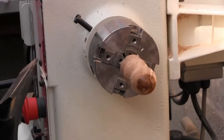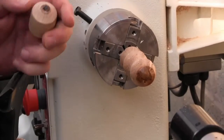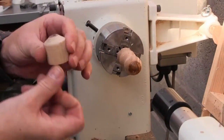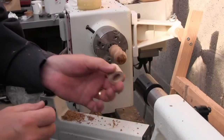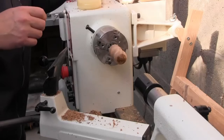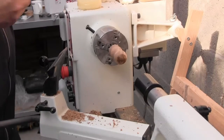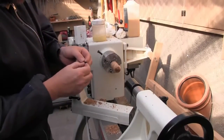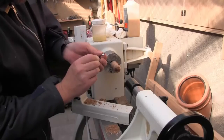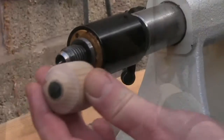I'll set the lathe off so you can hear me a bit better. Look at the other end of the lathe — the tail stock. Now everyone's tail stock is going to be different, but we've basically cut a little bit of scrap wood that fits over our tail stock like that. And what we do is use these little sticky rubber feet that we sell. I'm going to take this little sticky rubber foot and just pop it on the end of that scrap bit of wood.